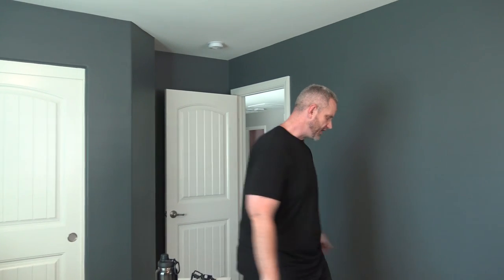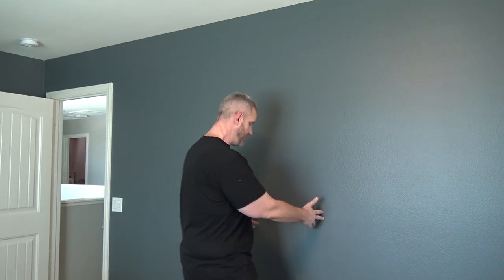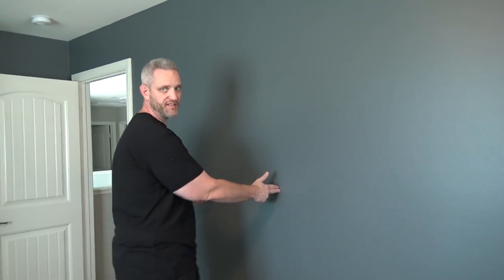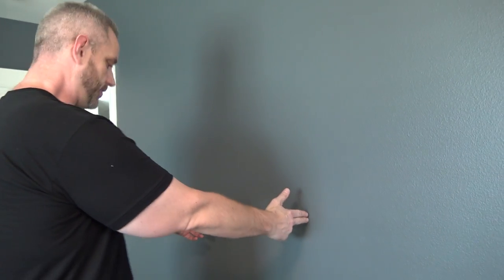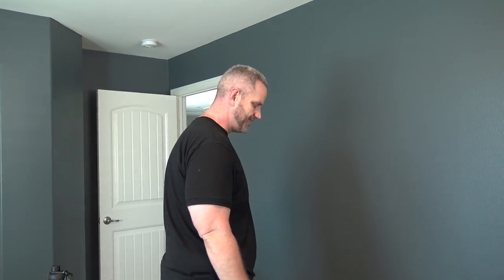So what I'm gonna do real quick is, based on my TV stand, which is over here, I know that I am gonna be mounting it to studs. I wanna try and center this as much as I can on where the couch is gonna be. So I've got a stud here and a stud here. Remember how I found those in the last video? I also know in the US we have 16 inch on center spacing on studs. I'm gonna have another one roughly here. Now I do have a stud finder and I'll grab that in a second. I'm going to probably mount the TV mount on these two studs, not these two, because that will be offset way more this way, I think. Crap. I should have left this there.